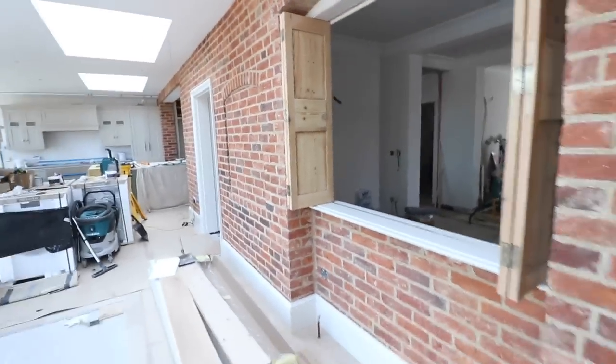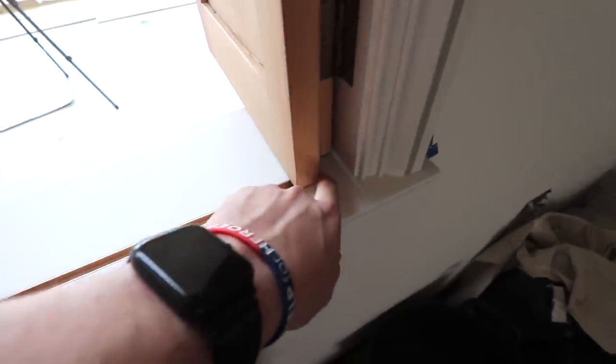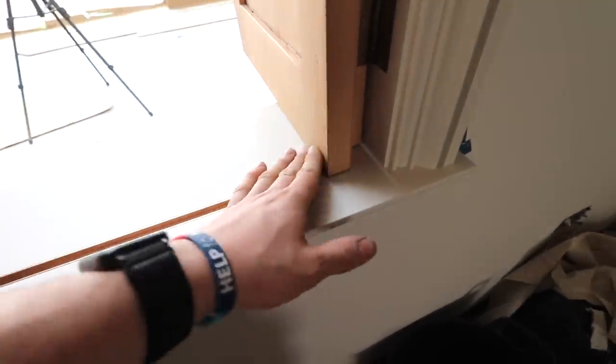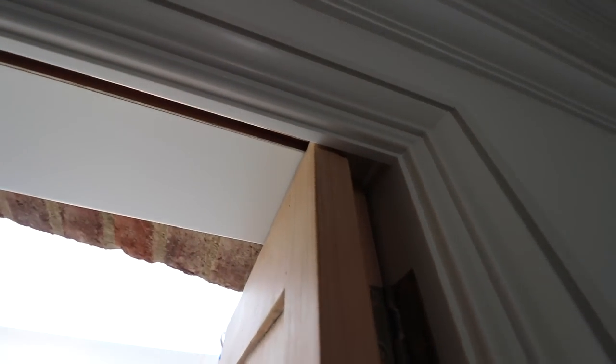They're perfect, lovely. See, my idea with the track was to stop it so that you didn't see the end of the track that would never ever get cleaned and always look dirty. So the end of the track there just stops underneath the door, which is quite nice. And I did have to take a little notch out of the back corner of this door, just for the way it slides. It obviously pivots around on that rebate. Just had to remove a little nibble out of the back there. You don't really see it even when it's open like that. It's not something that really catches your eye, but it needed that removing for it to be able to work. Still a work in progress, this side of the shutters.